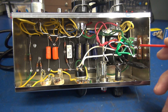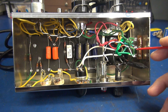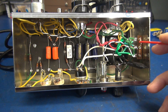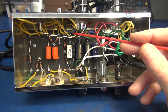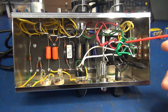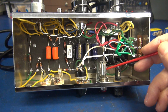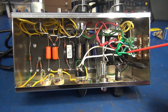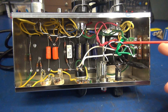In this case we used a star washer for a ground connection. The only thing better would have been soldering direct to the chassis, but the intent of this video is to give you a system you can install yourself. The center terminal is our ground lug; the outside two terminals are the 6.3-volt AC filament wiring. We have our 100-ohm balancing resistors installed. We take off to the 6V6 with 18-gauge wire, then reduce to 22-gauge wiring for the 12AX7. The dial lamp is also connected using 22-gauge wiring over to the terminal board. This area, which was pretty cluttered before, is now easy to access for future maintenance. I highly recommend incorporating this system when building these kit amps — it doesn't necessarily agree with Fender's original print, but it definitely eliminates confusion and makes the amp easier to work on.